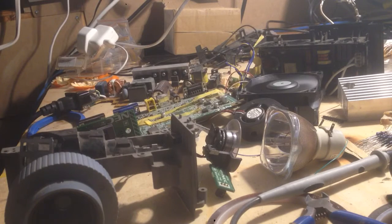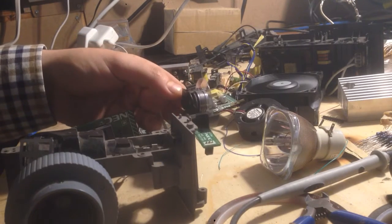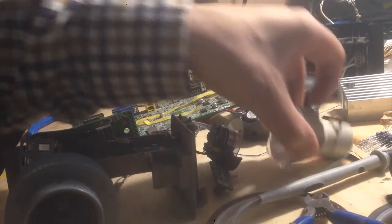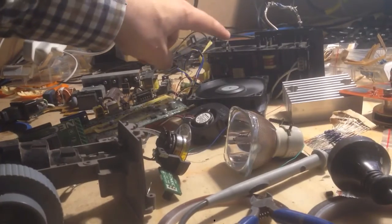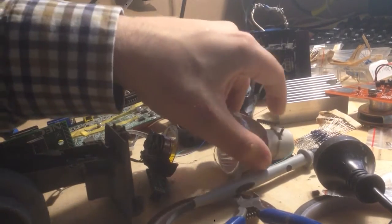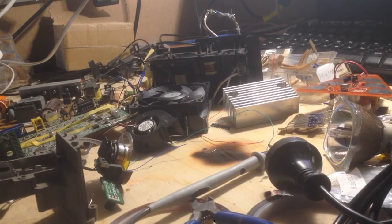Light goes into the mirror and is reflected off onto the optics. This is just a brushless DC motor — there seems to be some optical feedback in there. It doesn't work unless this little board is in place. The system also doesn't work unless there's something where the lamp is, so I have a big pile of resistors over here which occasionally spark in place of the lamp, and that seems to work.